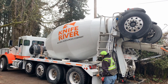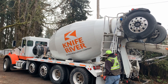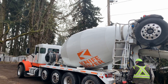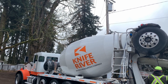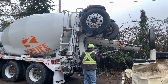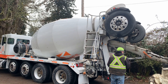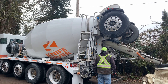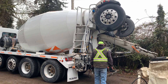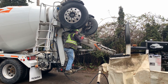How does he know how much water to add? It's metered right there where the sand is. So this is hot water he's adding? It should be, yeah. He just knows to put a certain amount — that's all controlled at the factory. They have exact settings because they have a lot of engineered projects where things have to be dialed in really tight. Is this any special type of concrete? Other than hot water and the slump — which is how thick it is — the size of gravel matters. A pumper truck with only a three-inch line can't pump gravel bigger than about a half inch or three-eighths. If it was a bigger pumper, you could go to bigger gravel, but it gets stuck if you go bigger than that.